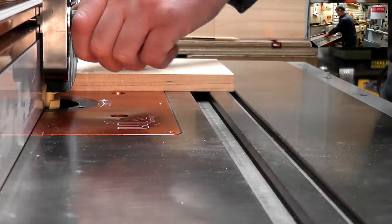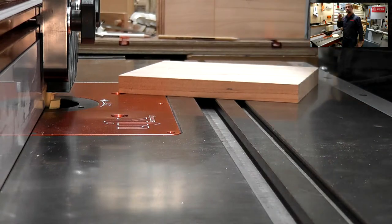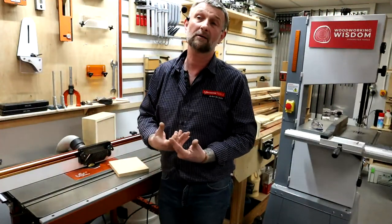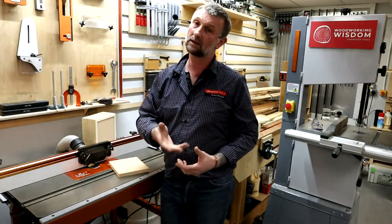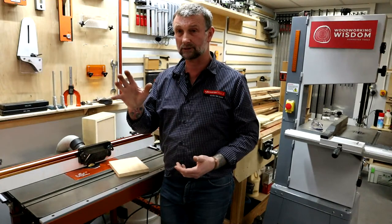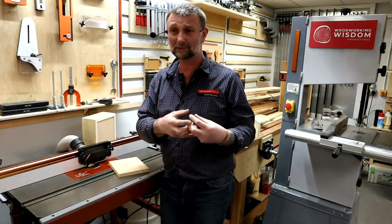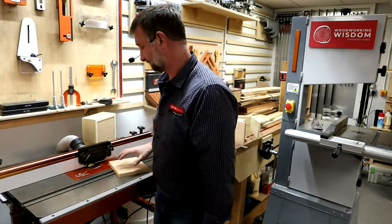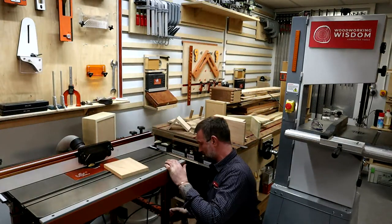All right. Check the speed. Whenever I put in a new cutter, I always wind the speed down to zero. It should be a given with any variable machine that you're loading in new tooling, new cutters, wind it down to zero, build the speed up gradually. It's better that something goes wrong at a very low speed rather than a very high speed. Same for turning, same for lathe work. So I will wind that right on down. There we go. I'll plug it in.